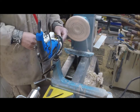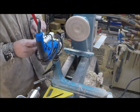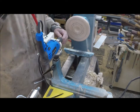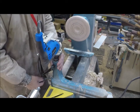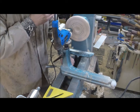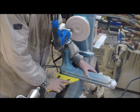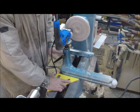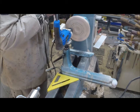So one of the things I like to do is I like to mark the holes first with a self-centering bit, or basically it's a starter bit. It's got a short shank, so it gets fairly straight. Line that up on the holes, on the line. Lock that, lock this. Okay, that looks about right.